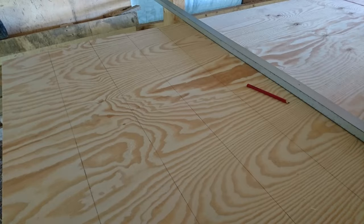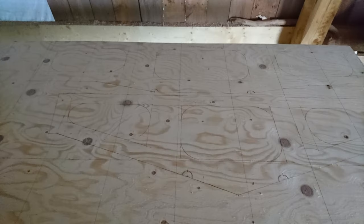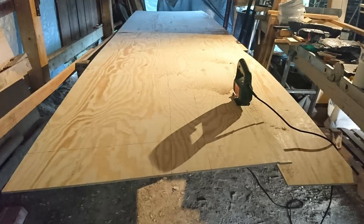When all sheets are ready the profiles can be cut out. I started marking vertical lines every 2 decimeters on all sheets. This makes it much easier to transfer the drawing from the paper to the plywood. Then you just need to mark out all the points and draw lines between them. This will take quite some time as well. Of course it's very important that all dimensions are accurate, otherwise the boat won't fit together.